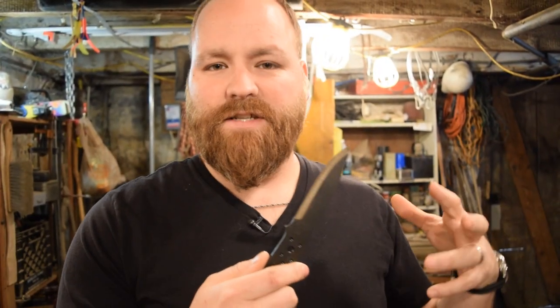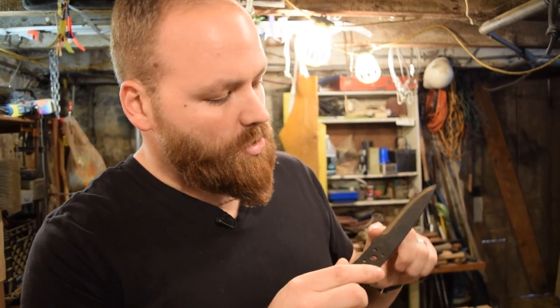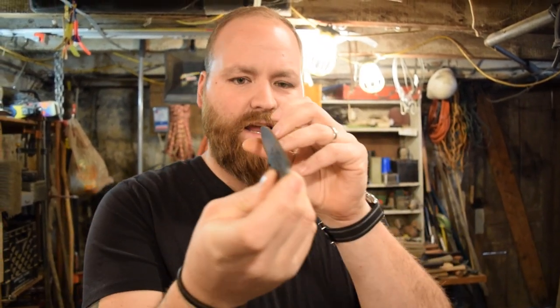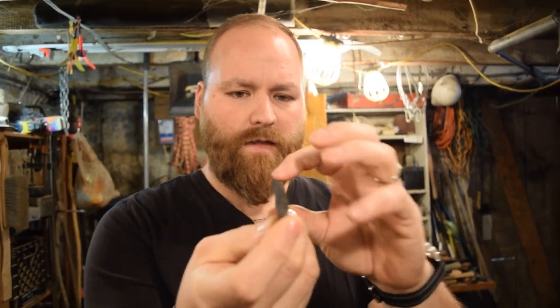All right guys, well I just got finished up doing both tempering cycles. Again, that was two cycles at 400 degrees for 2 hours each time. And I got a nice kind of straw color across the blade, which is what I'm looking for the temperature of my final temper. Unfortunately, there is a slight warp, and it's very slight, and you probably can't see it in the camera, but there's a little bit of a warp here in the middle of the blade.